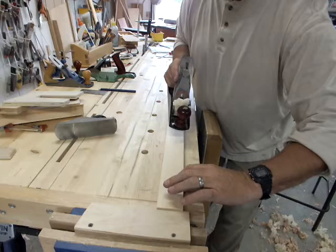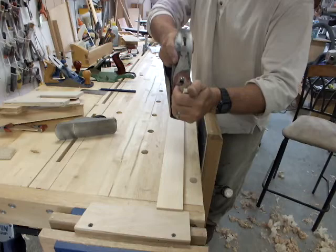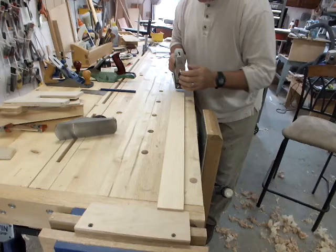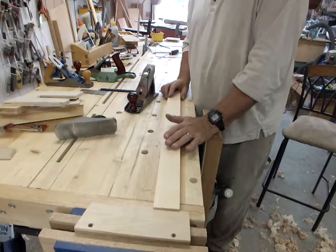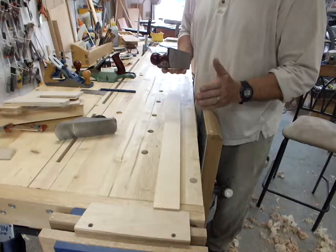I'm planing now and there's no bridge or anything. Right here's a little nick — take that out. This is now smooth and I'm halfway done. When I plane here I'll lift. There's a little bit of a transition there — I'll take this side off and it's just glistening and you're done. You cannot get that any other way in our 21st century with all of our technology and power tools. You cannot get this any other way than what we just did here in seconds. This is why you want at least to have hand planes in your shop.